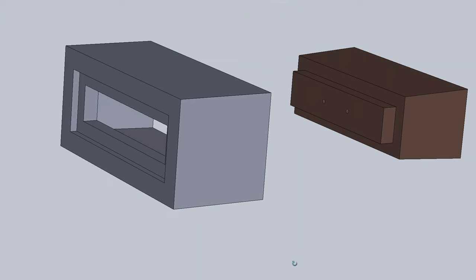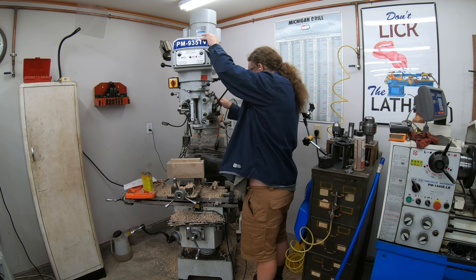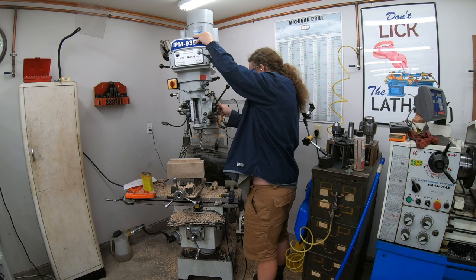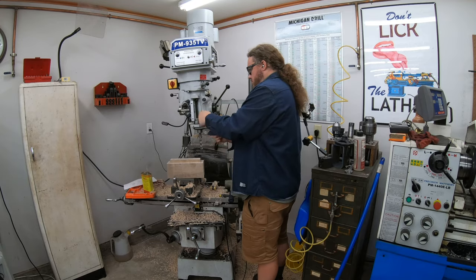Remember, lots of things are less dense than concrete and will float. The important thing here was that it needed draft on all its sides. If they were parallel, then even with a good mold release agent, the friction keeping it from popping out would be so high, I'd almost certainly damage it or the casting in the process of removing it.